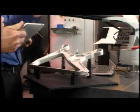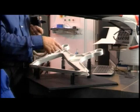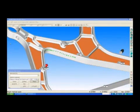Here's the power of PC-DMIS. We actually have a prompt that comes up to ask us if we want to scan. Maybe we might measure some of these other features before this process has even been machined into the part. So a prompt has come up, do you want to scan? The integration of the ARM into the software has really improved since Hexagon purchased Romer. I can answer a yes/no question right from the ARM. So I'm going to click yes, and now we're going to begin that scan. With the scan, I'm going to drag the probe along the part, collecting a sequential series of points.